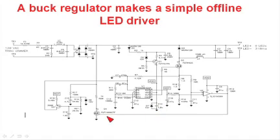Another thing in this circuit — you can see this transistor here, and we have a 1K resistor connected across the input line when it is on. The reason we do this is to provide some loading on the output of the triac dimmer. The triac dimmer has a triac used as a switch, but it also has a capacitor across that triac that serves as an EMI filter and provides a current path from the input through the power supply. Without this resistor, it is very hard to detect when that triac has fired and when it's not, and you get pretty sloppy dimming.